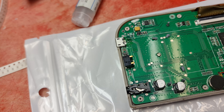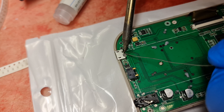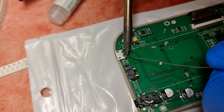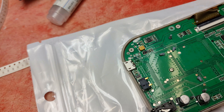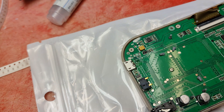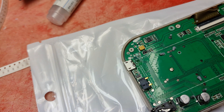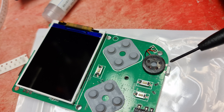It's going to be hard to see on camera but believe it or not they're actually connected. So I'll have another go — this time I'm going to go in with some 0.3mm solder, which is really fine. I've just been using 0.7mm. And I think that's got it. I need to get to the other side, so I'm just going to take this off camera so I can inspect it properly, because you can't do that while filming.